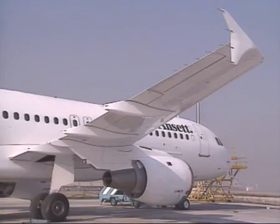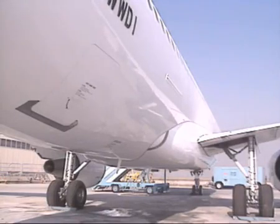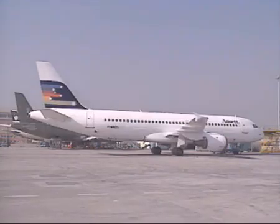Make sure that the speed brakes and spoilers are retracted, the thrust reversers are stowed, the landing gear is extended and the doors closed, the forward and aft cargo compartment doors are closed. All the other hydraulic surfaces must be in normal position.